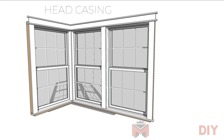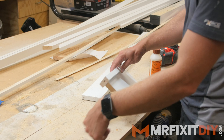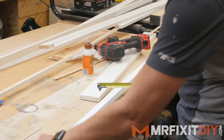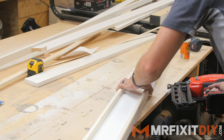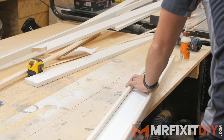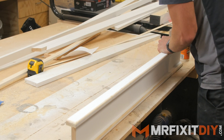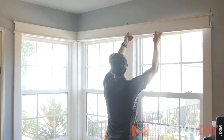Next, we can move on to the head casing — the decorative piece across the top of the window. What's cool about this craftsman style is that you can get as fancy as you like by building out your own profile. The craftsman style also helps you eliminate a lot of miter cuts, so it's not as difficult to get those nice tight miters — you can just butt everything together, which makes it a little bit simpler. In this case, I'm gonna keep it pretty clean and just build a basic craftsman head casing by using one piece of three quarter by three and a half inch pine and two pieces of three quarter by one and a half inch pine, and sandwich them all together. I'm adding the same quarter inch round over on the one and a half inch pieces, then gluing and fastening them to the three and a half inch piece with brad nails. The inch and a half pieces should stick out beyond the end of the three and a half inch piece the same one inch as the stool. Where the two pieces meet up in the corner, I miter each end at 45 degrees and attach the whole thing in place.